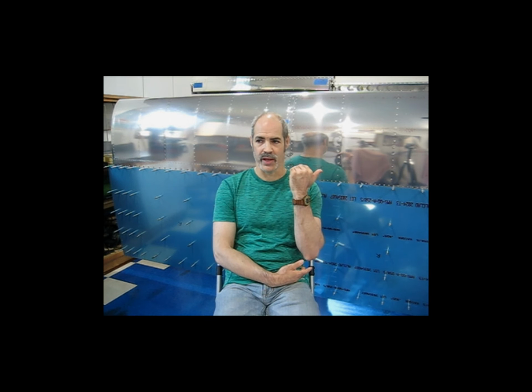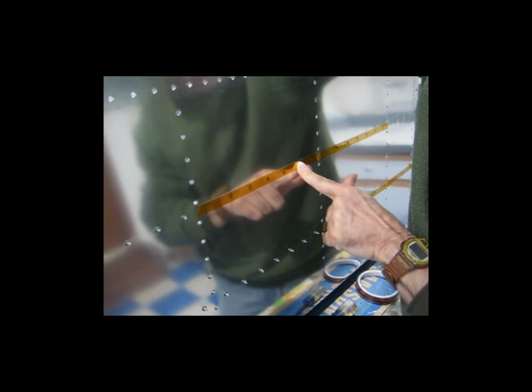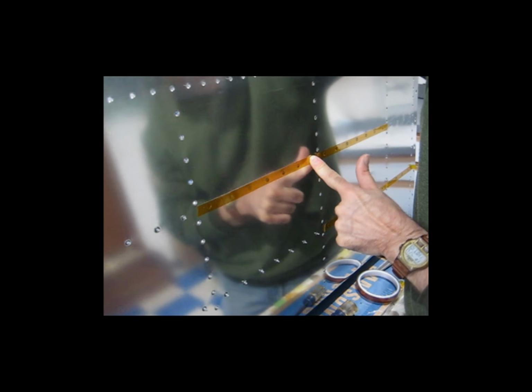And then I'll come back. Again, I support the stiffener with my hand on the backside. And I'll just go ahead and, again, drive these into the dimple. Just like that. And I'll do that for each stiffener. So now I'll come down here and I'll remove these clecos, put the rivets in, seat them, tape them, and move on.